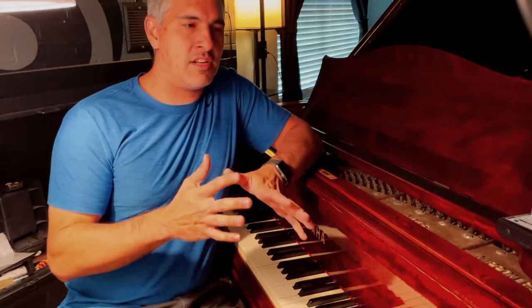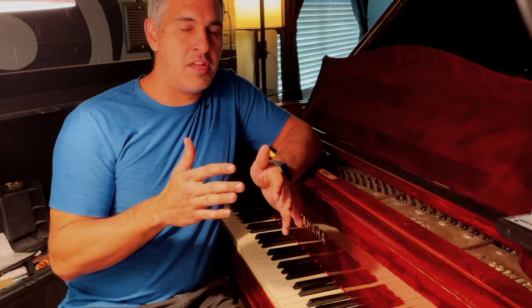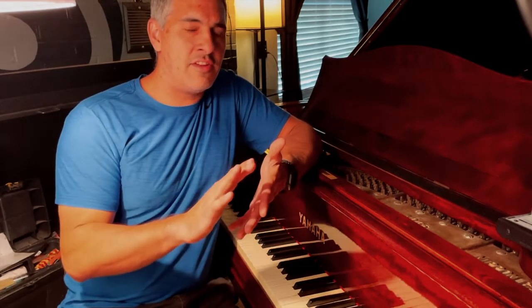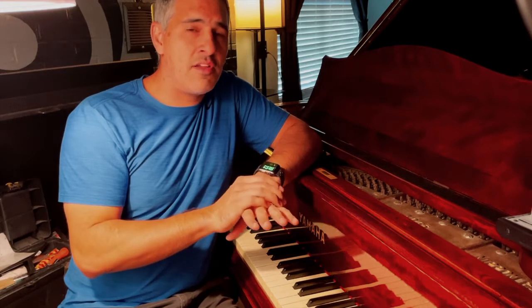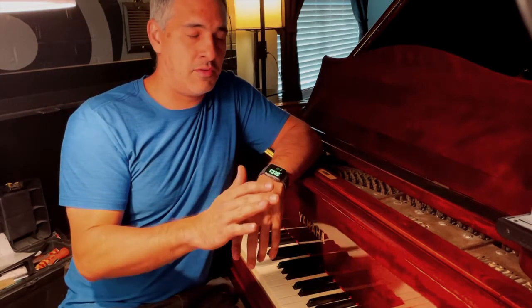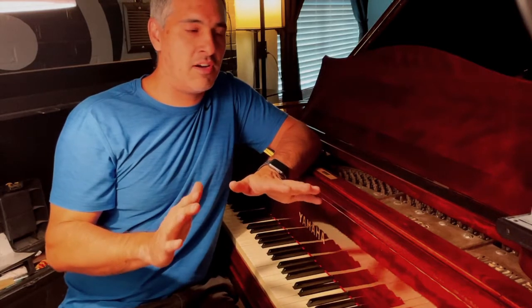So one thing I really liked about this system is it goes on in a few different stages. The isolante is the sealer that's meant to go over the bare wood. And what's cool about it is when it dries, it gives you a clear finish, but it gives you this satin sheen that's not super glossy. And I'll tell you, if I wasn't going for a super glossy piano, this satin finish is beautiful. You could just about put on this sealer and leave it alone. Just never touch it. It would be done. It's like a finished product.